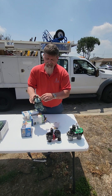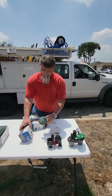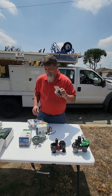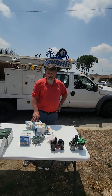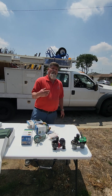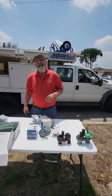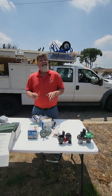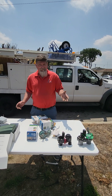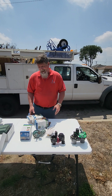On a brass valve, I can take the actuator off and replace it — they sell the whole actuator separately. Home Depot doesn't carry the repair kits, and most plumbing shops don't have them in stock, so you have to find it on the internet, order it, wait for it to arrive, then tear it all apart and put the brand new rubber bits in. When it leaks, you take it apart and put it back together a few times until you get it working — once it works, it's going to work forever.